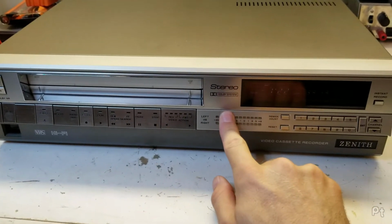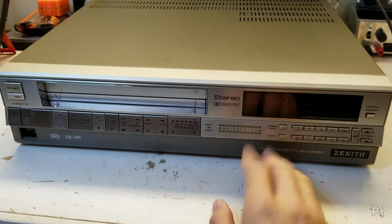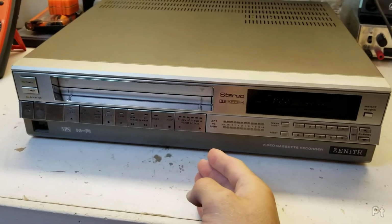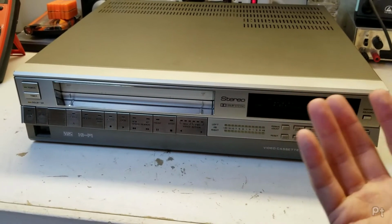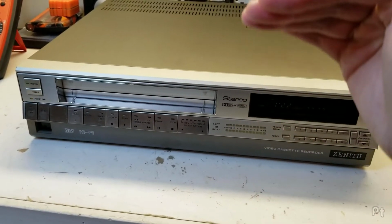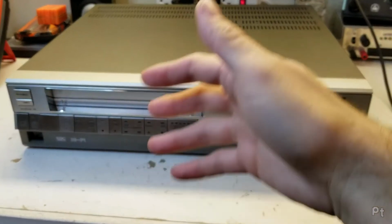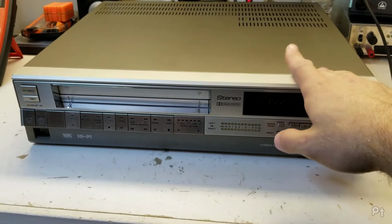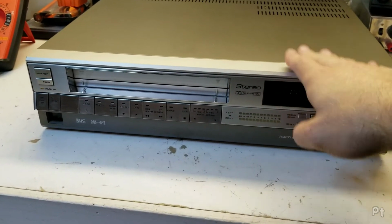Now, hi-fi surpassed compact cassette for quality, for the most part. In other words, you did not need Dolby noise reduction because the signal to noise ratio was so great, like 70 plus decibels, you don't get hiss. You can have very loud parts and very quiet parts, and you can have that dynamic range. It's like something stupid, like 90 decibels. The frequency response, 20 hertz to 20 kilohertz. The audio quality for hi-fi rivaled CD. And that's analog, CD's digital, but the quality still was there.